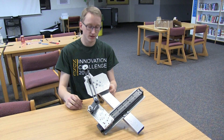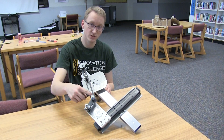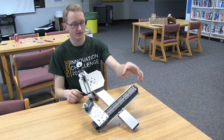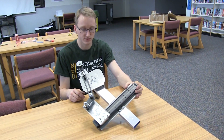To also make it a lot smoother, everything on here needs to be ball bearing. All of our joints are just bolts through holes and linkages — that's too much friction for a design like this. Every single joint would need to be a ball bearing, and the rail itself needs to be a ball bearing rail too. We tried with some slider rails and it was just too much friction for the system to work.